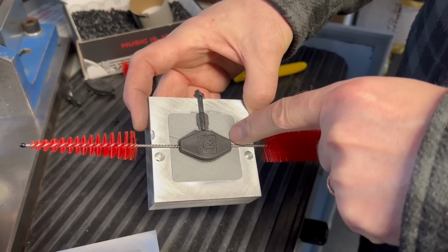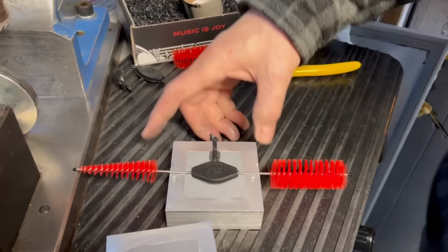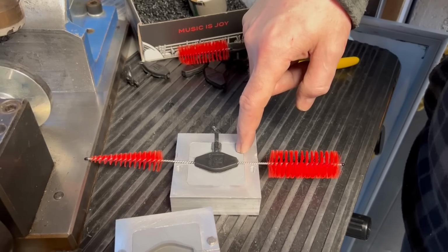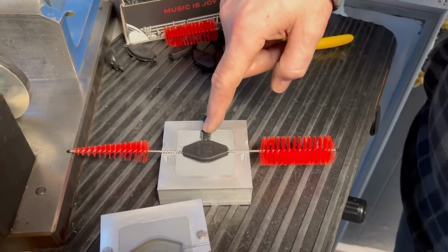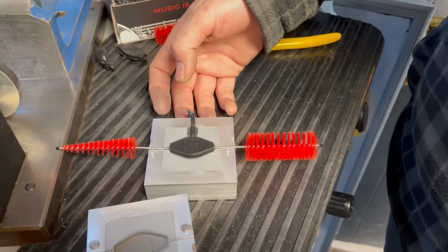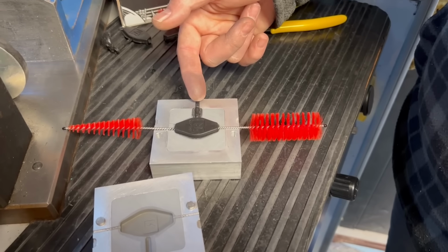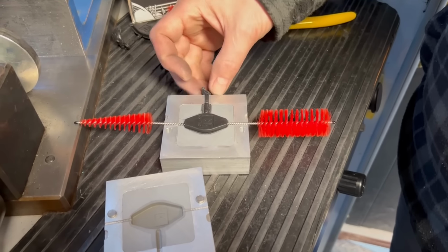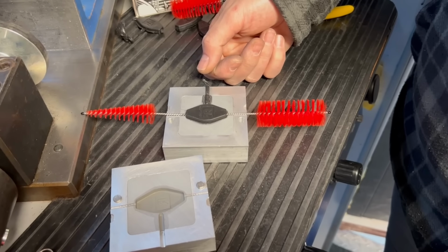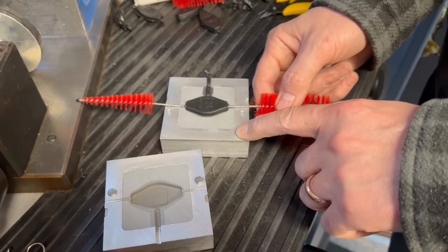Okay. And we were at 60 before. We were at 60 before when we tried it, but we didn't have as tight tolerances. And we were having all kinds of flashing and splooshing. And we had the top as essentially a pressure relief because it was not level. So all that pressure from 60 PSI was let out the top and let out the flash. And now the pressure's actually held. And it just cracked. And this is a lot of pressure because the cross-section is pretty large for this.